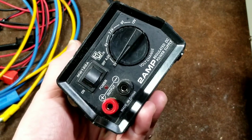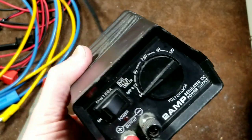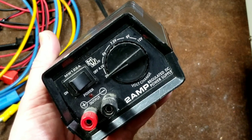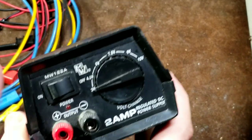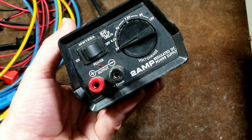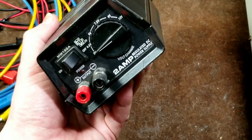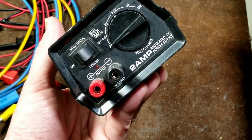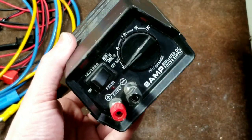The maximum output since this will only put out two amps — it will put out two amps irrespective of what voltage, which is kind of a weird thing. You'd think that going down lower in voltage it could put out more amperage, but the nature of the way these linear power supplies are designed, they're kind of like a Class A amplifier. They can always put out two amps regardless of voltage. So it could put out 24 watts if you're at the 12-volt setting, but only 6 watts if you're at the 3-volt setting. All these are actually fuse-protected, but if you overload them they'll just continue to drive it — you'll drop voltage when something's overloaded. That's the other nice aspect: they won't shut down. If you overload it, it'll just sit there outputting its maximum power.